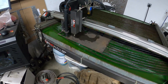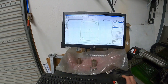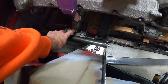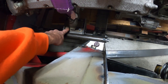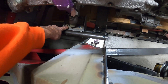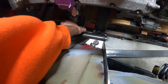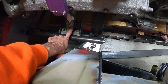What we're going to be doing is making a very simple component that we're going to use as a fixture to help position the top plates of the motor mount. The Ferrari mount has a big chunk of rubber in the middle of it, and because of that and because this is a used mount, we can't absolutely positively guarantee that the base of this mount — which we're going to be bolting our top plate to — is dead parallel to the base of this aluminum casting.